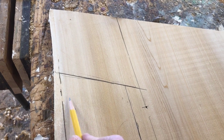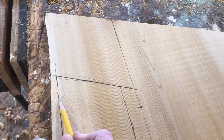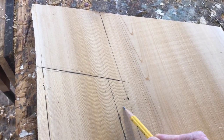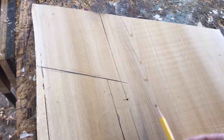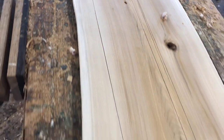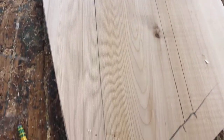So I connected the points on the upper edge of the plank with a batten — which is a long, thin, flexible piece of wood — and I added three quarters of an inch overlap to the lower edge of the plank and drew that all the way down the length of the boat. Everything looks good, there should be plenty of plank, and everything should fit perfectly. The last thing to do is to cut it out, and we'll do that in the next video.